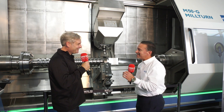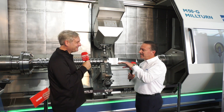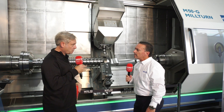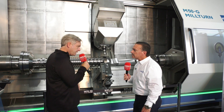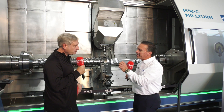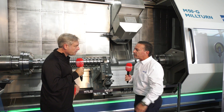Measuring down a 3-meter bore is really tough — a long probe will tend to dip, so they try not to use that. Instead, they do ultrasonic measuring — by sound — which can determine wall thickness and concentricity. You measure the OD with a probe as usual and the ID ultrasonically, giving you exactly what the wall thickness and concentricity is at any given point along the entire part.